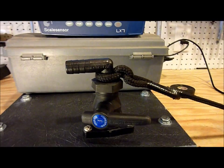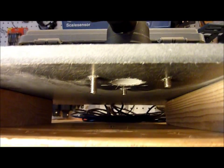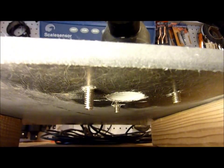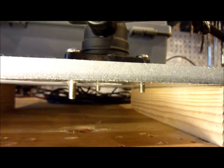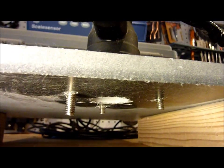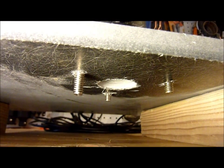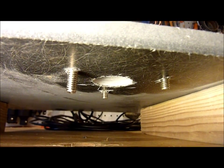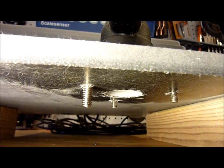We're going to test another seacock here, only this time I'm kind of being unfair. What I've got here is a half-inch GPO-3, which is a pultruded fiberglass board. I recommend it on my website for backing blocks, and one method I offer is to drill and tap the backing block if you're using GPO-3 or G-10.